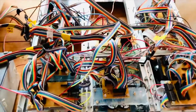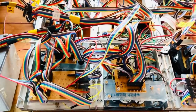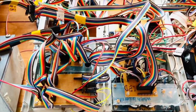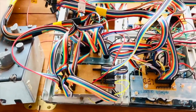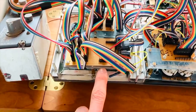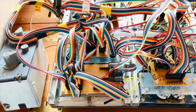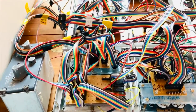Over here — welcome to spaghetti land. I'm sure you're thinking, what's going on. That's because with OpenCockpits I need to wire all the seven-segment displays from here all the way to the interface cards. Other solutions have microchips down here with the seven-segment displays and you just need a small ribbon cable, but I need the wires from these displays going all the way to my interface card, which is placed right there.